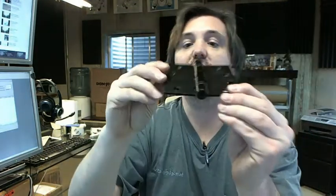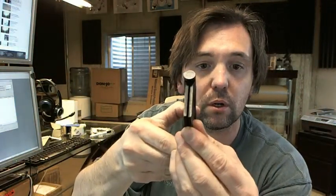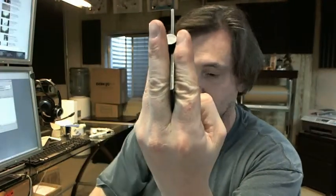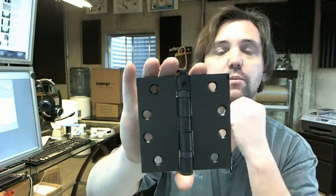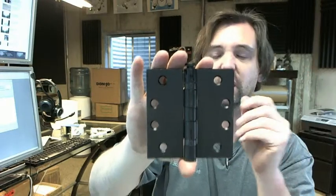As you can see, this is a full mortise hinge based on the swag of the leafs, such that when the hinge is closed you can see that everything would be mortised to the edge of the door and frame. It's 129 thousandths of an inch leaf thickness, which is standard commercial grade thickness for a 4x4 hinge — not residential thickness, where it would be 30 to 40 thousandths thinner than this.